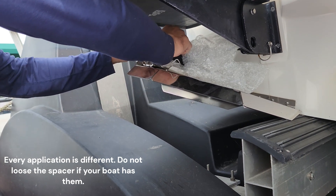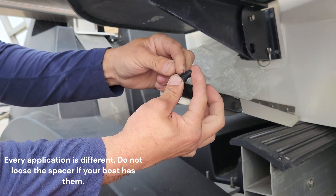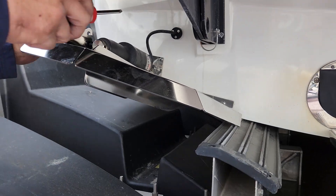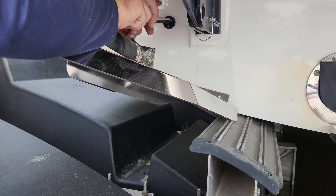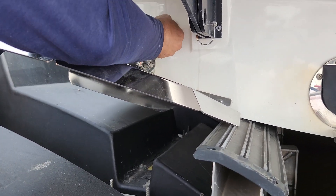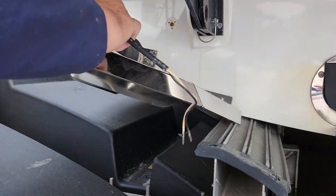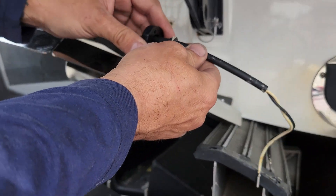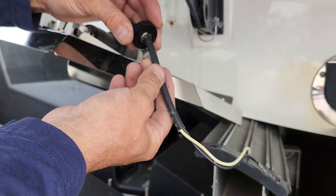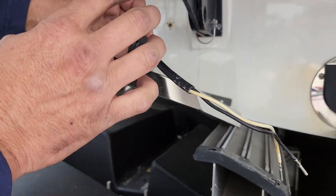The other nice thing here is that these ones actually slide in. Sometimes you'll take these off and the piece isn't there — it's cut right here so all you have is this little roller, and if you drop it, it'll go into the water and sink. You can see when this goes in through the hole it has a mushroom-like spacer or rubber grommet and it fits directly into here. As you push it against the boat it presses out so water can't enter, but we're still going to put silicone on it as well as the screw holes so that no tiny leaks can enter the boat.